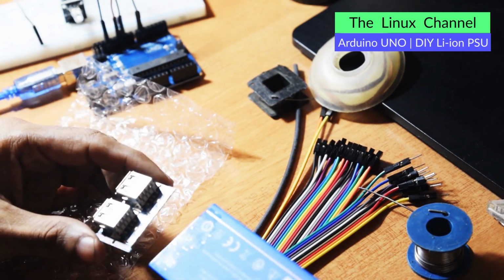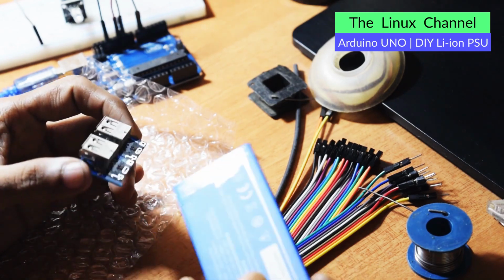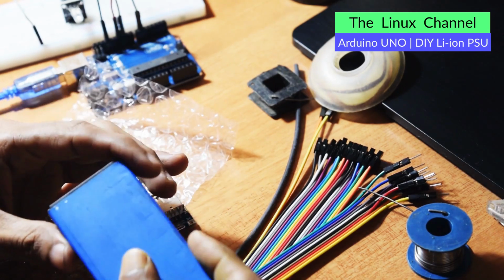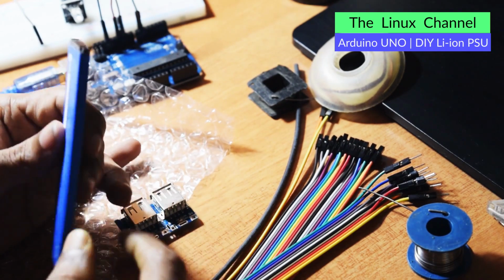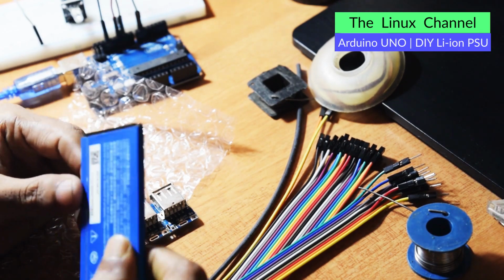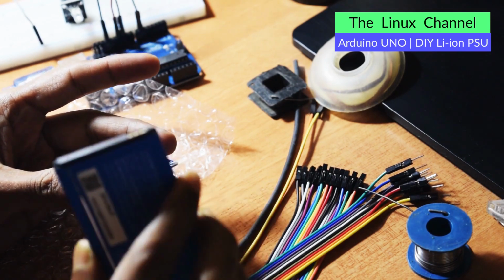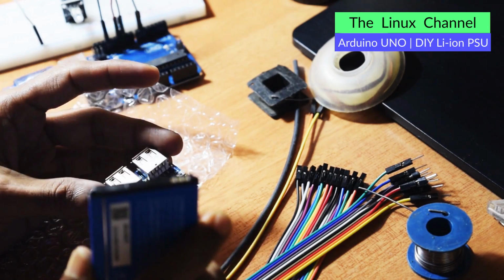At this moment I just want to hook everything up so that we can test if this is enough to power this Arduino, and we can see how we can use anything like this. It is quite handy. These kinds of batteries are quite good because they come with some amount of cell protection circuit, as we know already. We can also hook this directly to any 18650s, but hooking to this battery makes more sense. We will have dual protection, so if anything goes wrong.